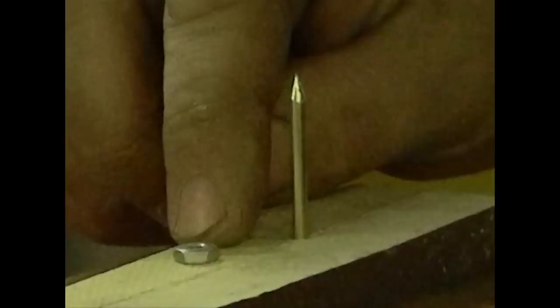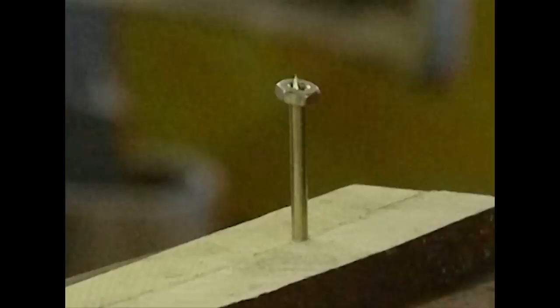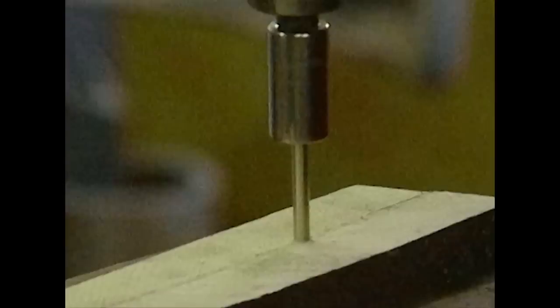As you can see, I've tapered my brass rod to a point, and I have a small nut sitting here. This nut is small enough where it won't fit easily over the brass — that's where the taper comes into play. Because brass is such a soft metal, you can use the nut itself to thread the brass rod. You can do this with a socket wrench, but I'm going to use my cordless drill here because it's going to make that job a heck of a lot easier.